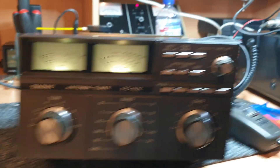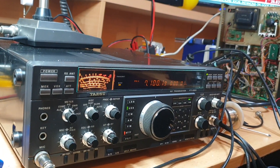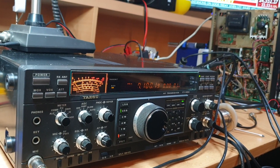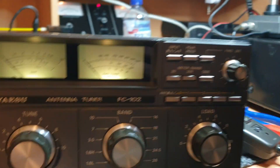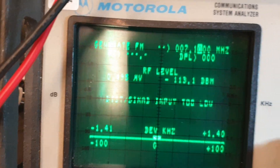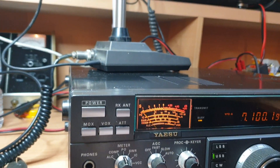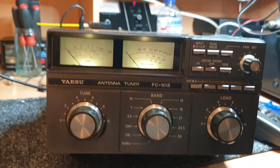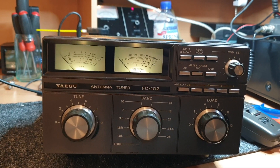What we're going to do is — I've just got it hooked up to an FT-990 here, which, before that goes out to a mate of mine, we'll hook that up for a bit of fun. What I'm going to do is inject a signal through — just a very low signal, about 0.5 of a microvolt. So I'm not putting a lot through there. That 0.5 microvolt tells us the tuner is hearing it beautifully, so all the through-switching is working like it should.